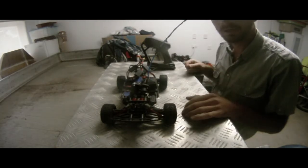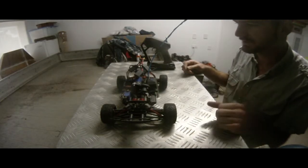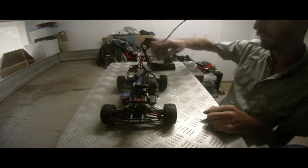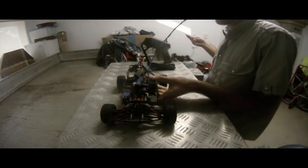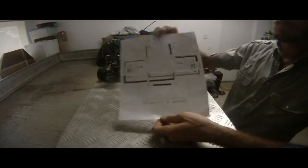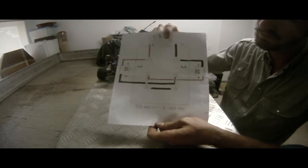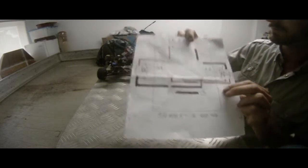Just thought this would be a handy video for anyone that wanted to make their own harness the same as what I've done. All I've really done is just taken a couple of the Traxxas parallel and series harnesses and rewired it to that switch. And I'll quickly show you the little diagram I made up — this is how I made it. So if you have any idea of wiring or electronics, these are the six points on the back of the switch.